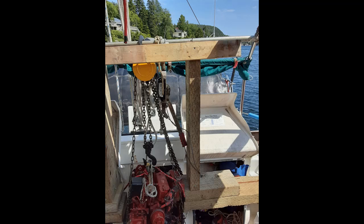I did use a chain hoist, which I borrowed from a neighbor. You probably could do it with a come-along or a block-and-tackle, but the chain hoist is very effective because you can move it an eighth inch at a time. You can lift it up, pull it forward, ease it back a half inch, which is a little more difficult with a come-along or a block-and-tackle. I would highly recommend a chain hoist — rent it, purchase it, or borrow it.